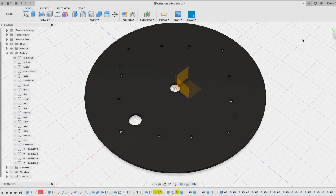So let's talk about the dial. This we will be outsourcing. We've thoroughly vetted our supplier and we are confident that we can trust them to create a high quality piece. The reason it's being outsourced abroad is that it requires injection molding, and tooling costs for injection molding, especially hard plastics, are extremely high, as you will see when we get to the prototyping phase in the next video.